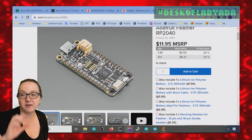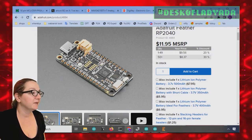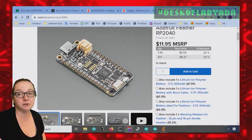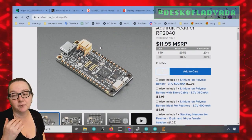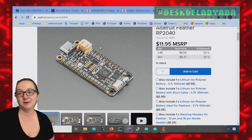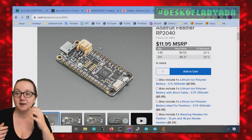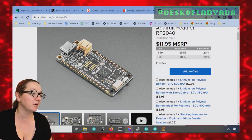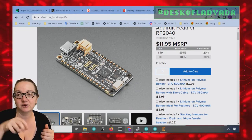Sometimes you don't want the bulk of having the connector on there — it also costs more money and is just another failure point, especially if you don't use it. I don't even need SWD to program the RP2040; it has a UF2 bootloader built in. So I leave that spot blank. On a previous Great Search I showed you can buy through-hole or surface-mount SWD connectors and plug them in, but a lot of people find that really annoying.